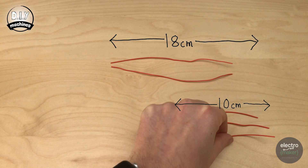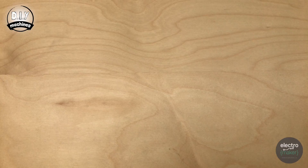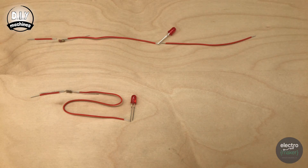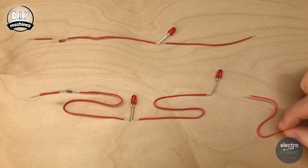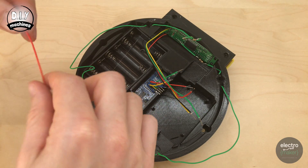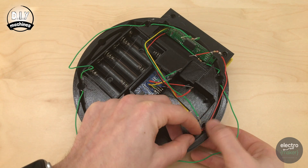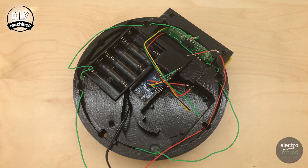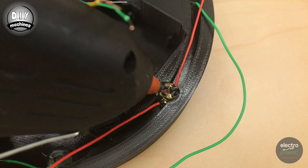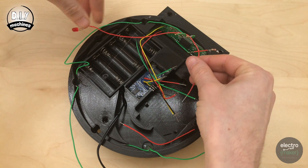Now we'll start work on the red LEDs. You'll need to cut another set of wires as shown, and then we're going to assemble it like this. Again, if you prefer a circuit diagram, you can pause the video or you'll find a link to the diagram in the description below. We'll start with the strip with a single LED — as with the green LEDs, the end of the resistor wants to be towards the display. Push this through and add some hot melt glue. Now the strip with two LEDs is used to plug the last two remaining holes.